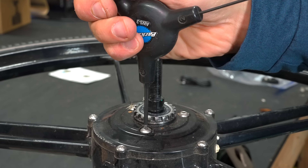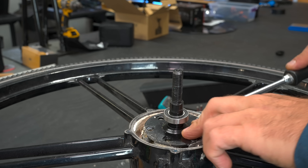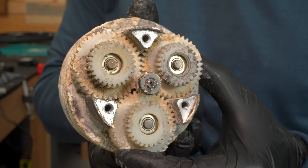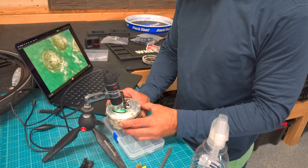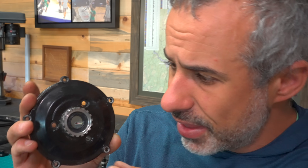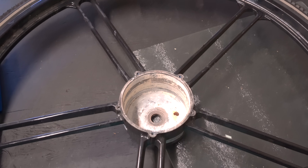We've got a brushless motor and some gears. Is this fixable? Yes, of course anything is fixable, but why is this board fried? We're getting into a situation where the deeper we dig, the worse this could get, and the more time we could sink into this. Could we possibly replace that front wheel? Well, the big problem with that is that this cover from the hub actually engages with the brake. We'd have to have a whole new wheel with the same spline, which we don't — so this is going to get really expensive if we can't fix that little circuit board.